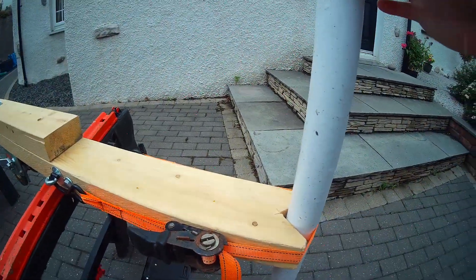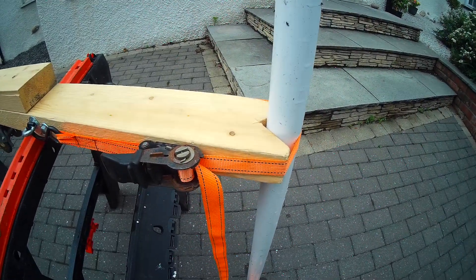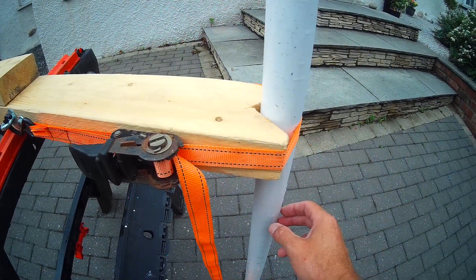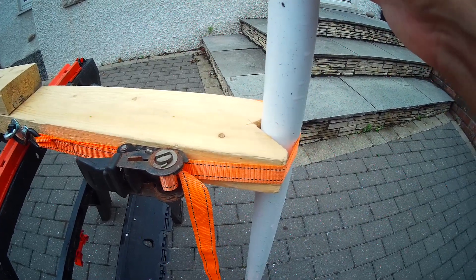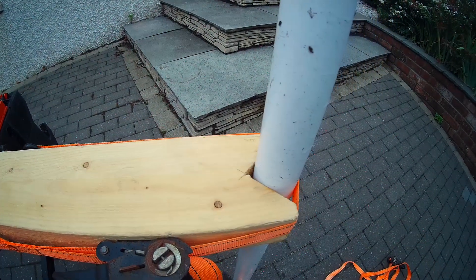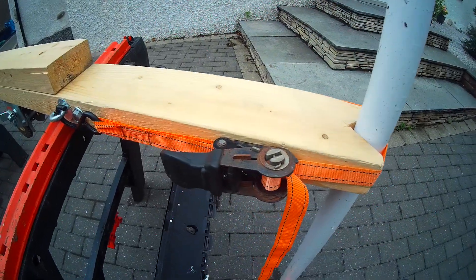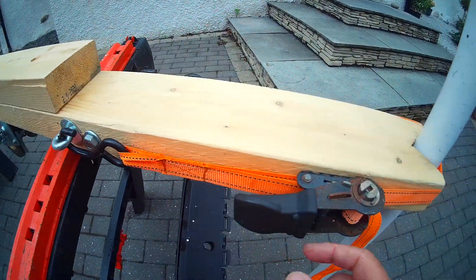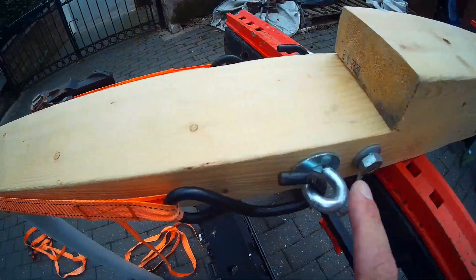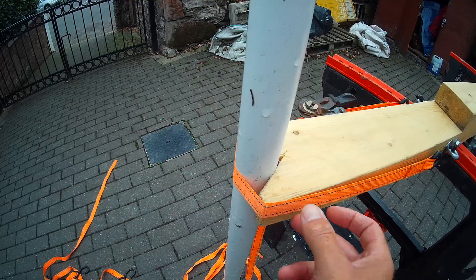At this end here I've got this bit of plastic tube to represent the mast — obviously it's not the same size as the mast, and it's not easy to film this on dry land. So using this bit of waste pipe to represent the mast, I've cut a V-groove in the end of my contraption here. To hold it in place while setting up and whilst raising or lowering the mast, I strap it with ratchet straps. I've got eye bolts going up through the timber there, just to hold it in place and stop it moving up and down.